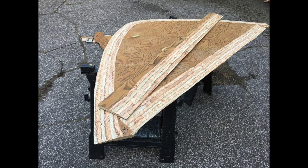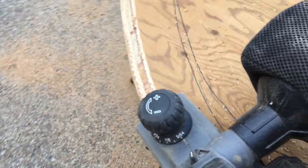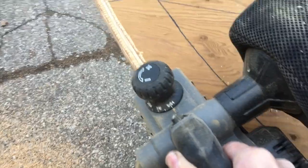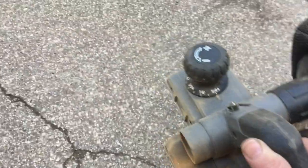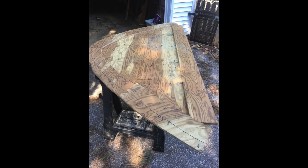Because I wanted the new deck material to be one solid piece, I beveled the edges and cut curved pieces that would fit underneath. The idea was to have solid core that I could slide under the edges left for adhering the new glass to. I made patterns, cut them out, and beveled them so that all the edges would fit together with thickened epoxy, making the deck structure one solid piece.